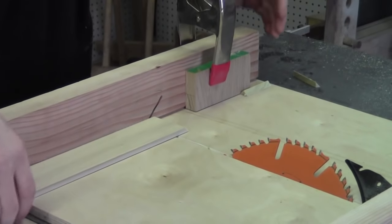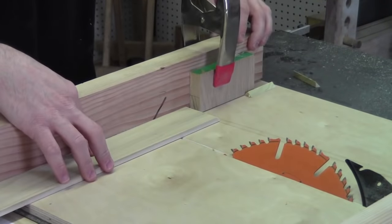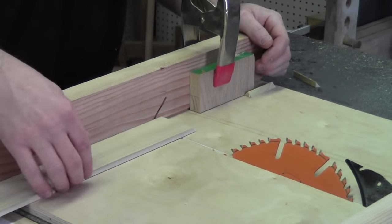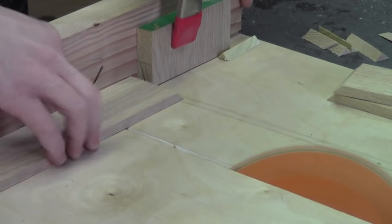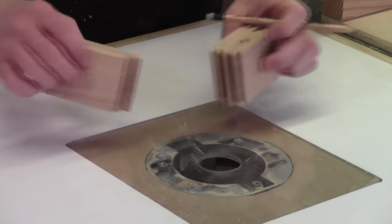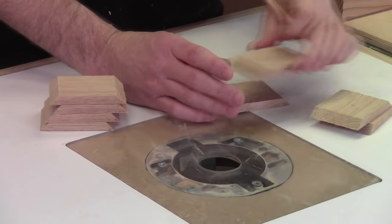For a quick walk-through: I'm going to use a scrap piece as an example. The first thing I want to do is make my first miter cut. From there I'll flip the piece, slide it up to my stop block, and make my second cut. I'm going to continue that for all four pieces, and that will allow the grain to run continuously all the way around all four sides of the box. With both boxes cut, I number the pieces from the top down — four, three, two, one — to keep track of the order.